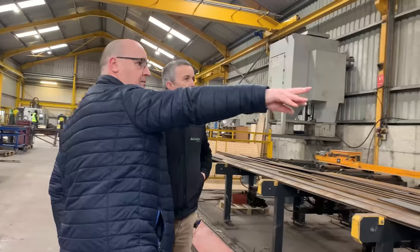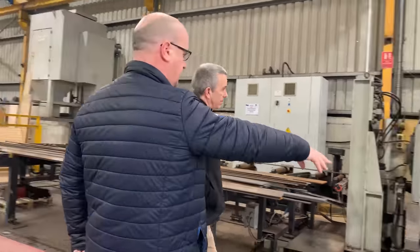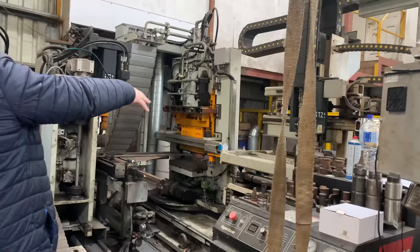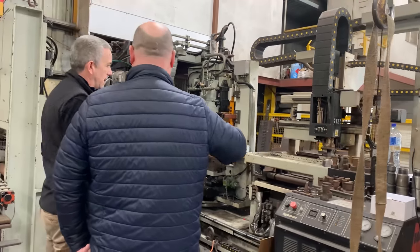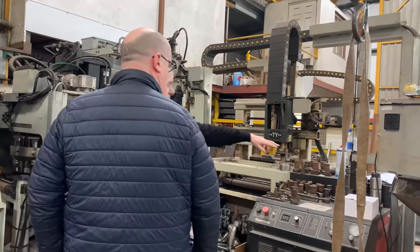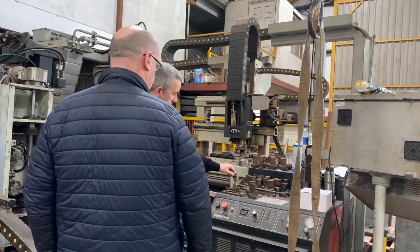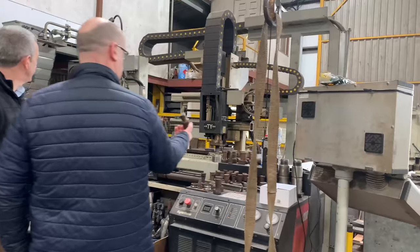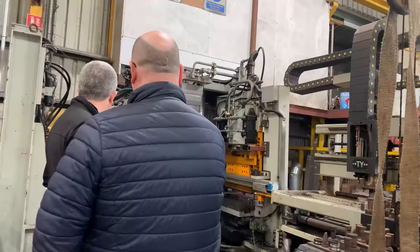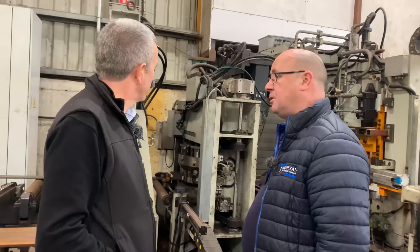What machine does that tap? On this one here. And also this machine, it has a plasma head on it as well. So if you need to cut any shapes — be it circles or oblongs — or take the corners off plates, it also does that. Are they the dies there for threading? They're the dies for punching — all your punching dies there. You can go all the different sizes right up to the real big ones. And they're done automatically — it's all done automatically here. They're all on that wheel inside, so it can change whatever punch size you want.